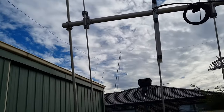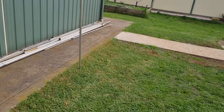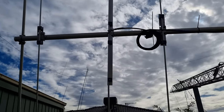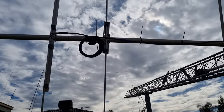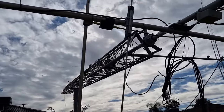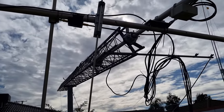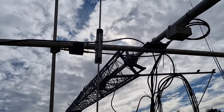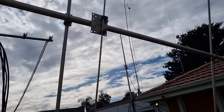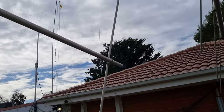So this is the reflector of the tri-band. I haven't got the trap on the bottom because it's been modified. Then we have the driven element, and the first director, then we go to the second element of the tri-band, and then we've got the second director, the third director, and the fourth director will go just in front of the other one there.